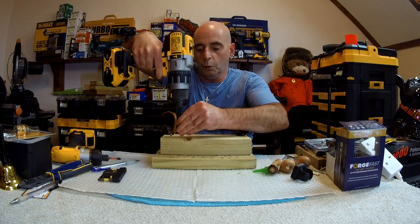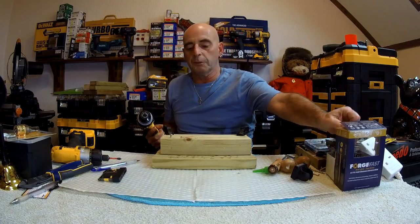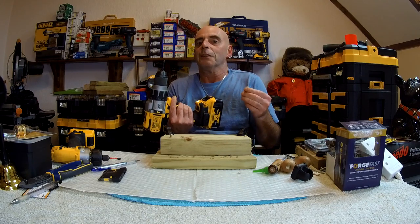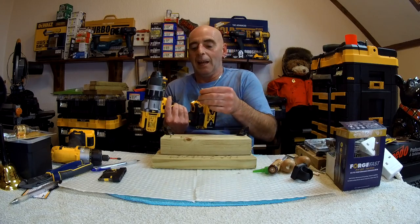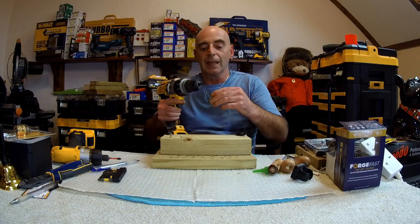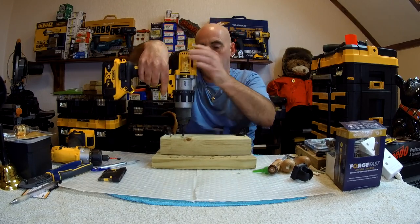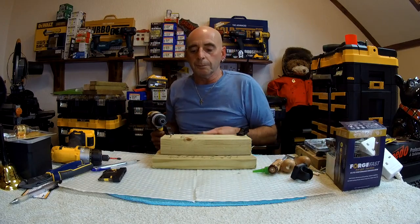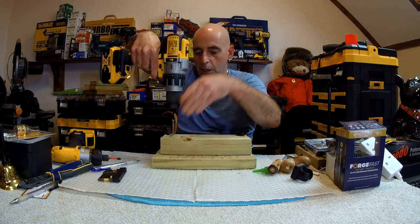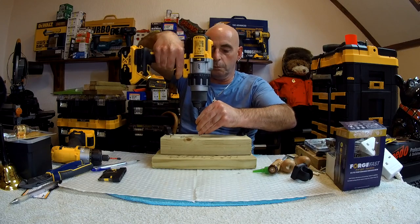So now we know that's no good. Roughly the setting to put these screws in is somewhere on speed two. Moving to speed two, we know it won't do it on clutch one, so we move it up one torque setting — that's two and two. Let's see what happens. There's a knot there — actually that's my mistake, there is a knot. It's a bit tight, which again is indicative of the problem with these electronic clutches. I'll do two more screws and bring it round to show you.